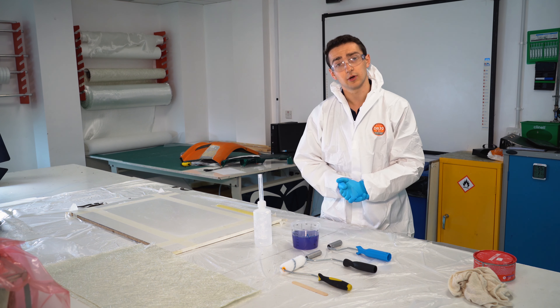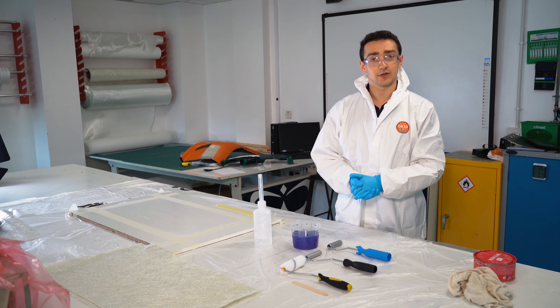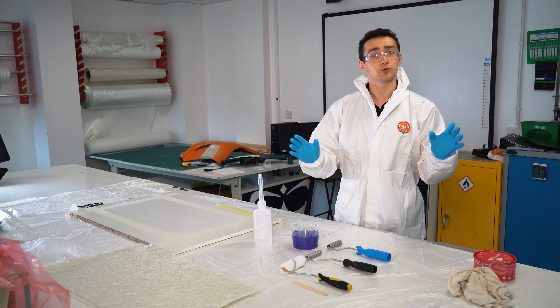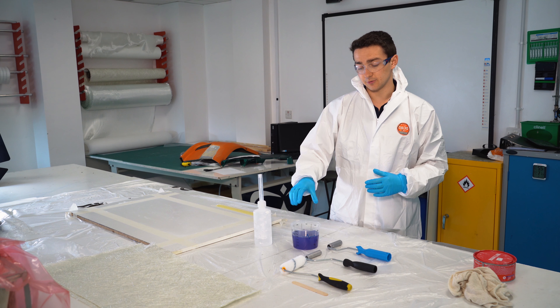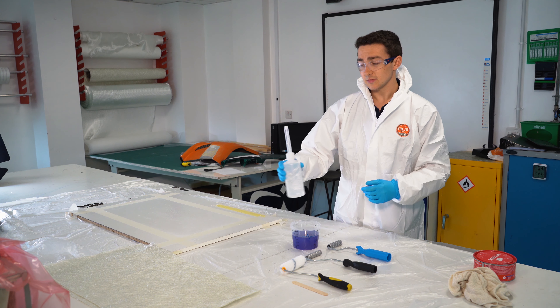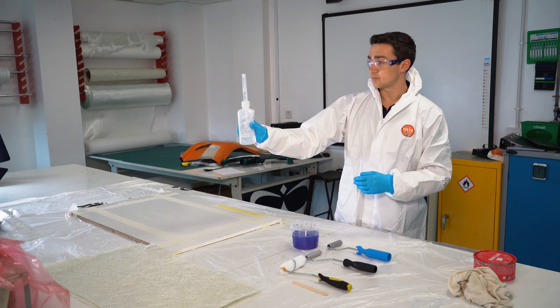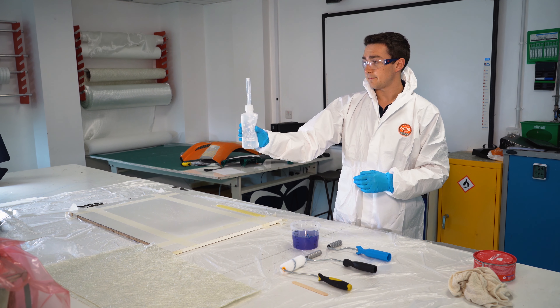Catalyst is the most dangerous thing that we work with here. It's highly corrosive and it's very much an irritant as well, so if that gets on your skin it's not going to be very good. For that reason, we need to make sure that we wear all of the relevant PPE — that includes goggles, blue nitrile gloves or in some cases black marigolds, and also a white overall as well. We add catalyst at 2% to the amount of resin that we have. Here, I've pulled out 400 millilitres of resin, so that means we're going to add 8 millilitres of catalyst. Holding it out from a distance, you want to push it and fill it up until it goes up to 8 millilitres.